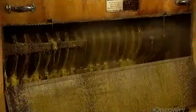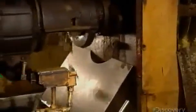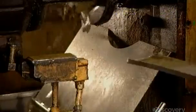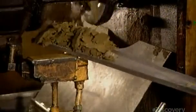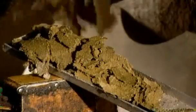As the shaft turns, its threads squeeze the flakes with high pressure, forcing out the oil, which then drains out through the slots. 42% of canola seed is oil. This screw press extracts nearly 3/4 of that. The remainder is still trapped in the pressed flakes, now referred to as canola cake. The cake exits the other end of the press and moves on to a second extraction.